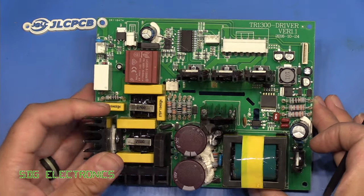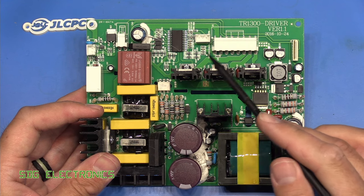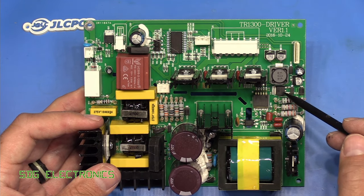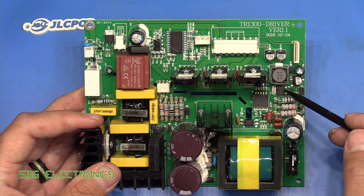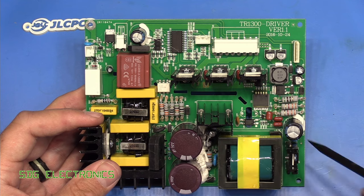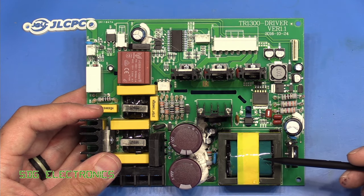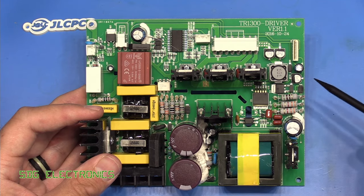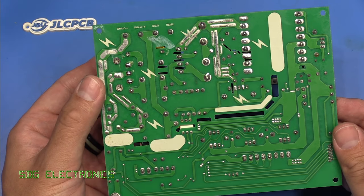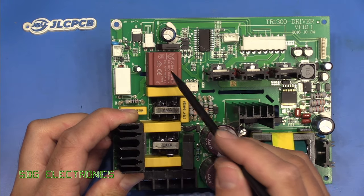The heating element in this unit is mains powered, so really this is just powering the blower and the electronics, so that blower must be quite high power for the transformer to be this large. We've got the brushless DC motor controller with six MOSFETs so that we've got control of the three sets of windings. We've got the connection off to the front panel PCB and this is the connector that goes to the blower motor. So we've got some low voltage DC supplies here — the power comes out of the switch mode power supply, goes straight to the brushless DC motor controller, and then we also have a little switch mode DC-to-DC and a 78M05 regulator here. Presumably we're getting some intermediate voltage — maybe 12 volts — plus a 5-volt supply. The brushless DC motor runs from 24 volts, so that's presumably what this transformer is outputting.